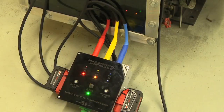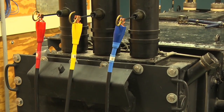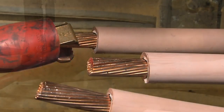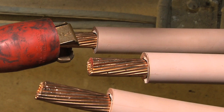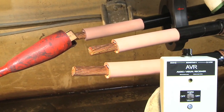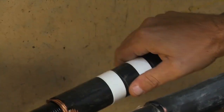When working underground with cut cable, start by setting up the transmitter or sender at a location with known phases. In a manhole or ditch, install a jumper from the center conductor to be tested to ground. Next, place the CT clamp around the jumper cable and using the DAVR, determine the phase. Proceed through all the cables to be tested and again mark or label each cable accordingly.